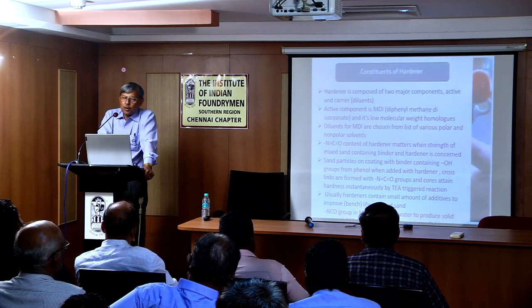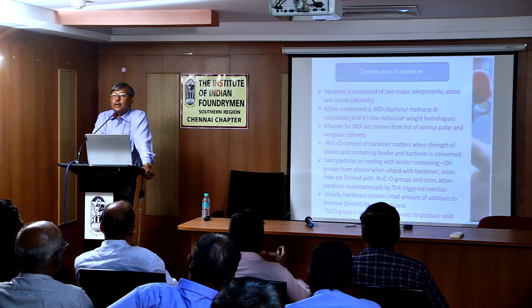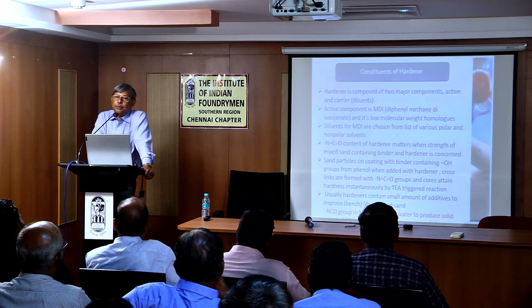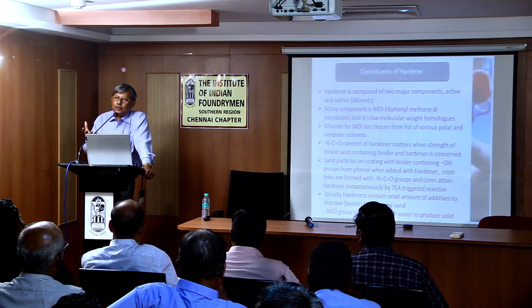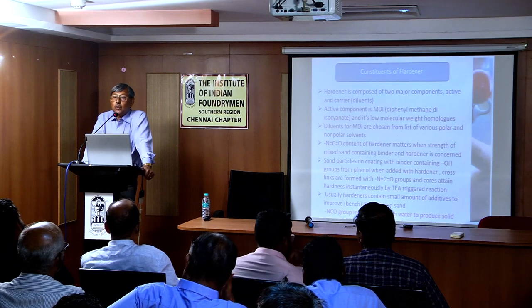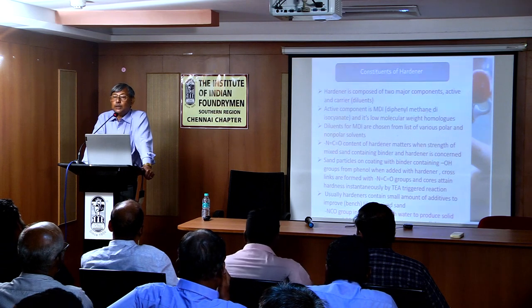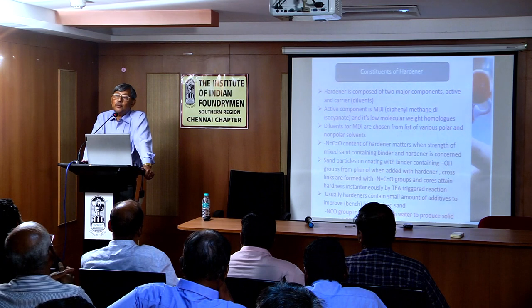And most important is NCO. You must have noticed that in the rainy season, if you keep the hardener in open condition, it becomes solidified. A solid mass is obtained. That means the hardener is spoiled. The active component in the form of NCO is gone by reacting with moisture. Not water, even moisture, it reacts and is spoiled.